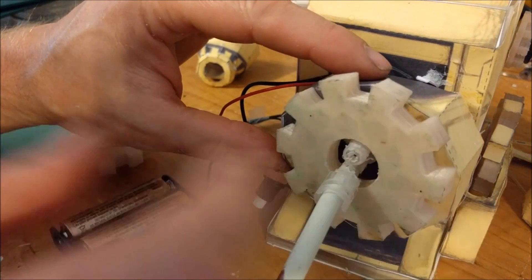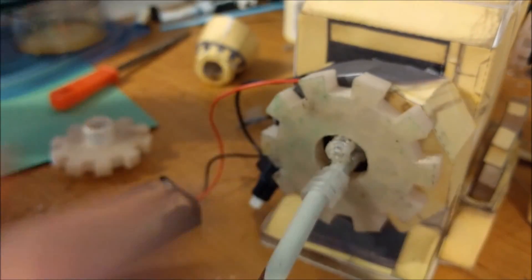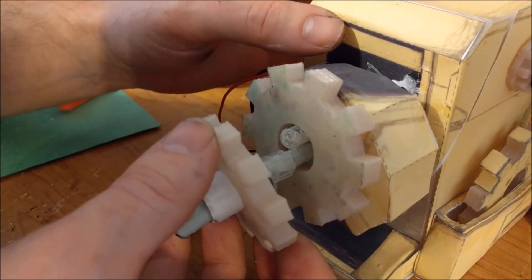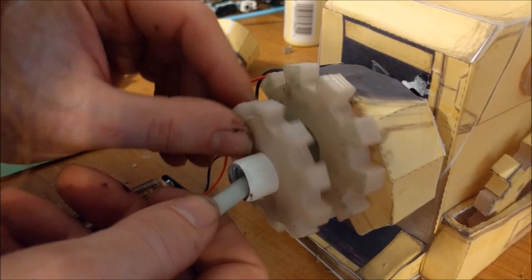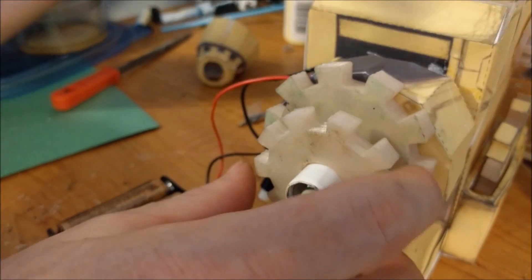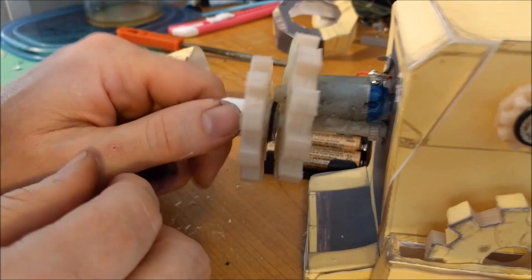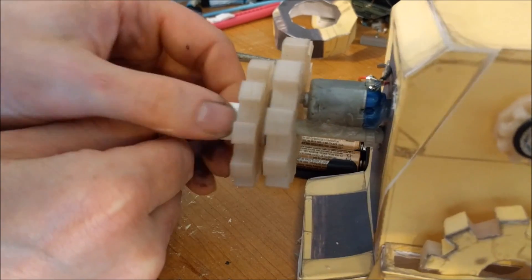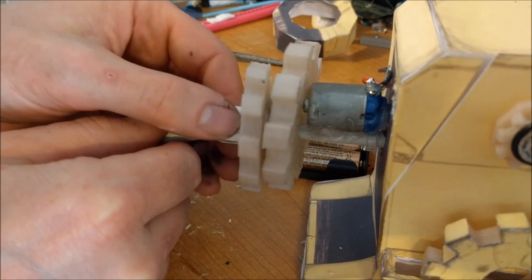As this one turns on the motor, it's just loosely on the shaft. Hopefully it won't bind, but it doesn't really have anything to keep it true. Then the one on the bottom will be turned from the bottom of the spindle of the motor, so it'll turn in the opposite direction. If you want to design things to be forgiving of inaccuracies, it's a good thing to do. This is extremely inaccurate, and yet it potentially actually works.